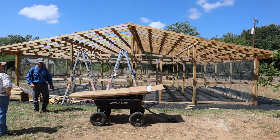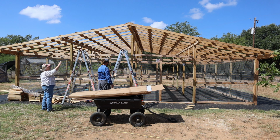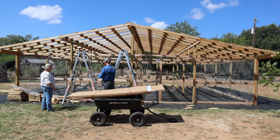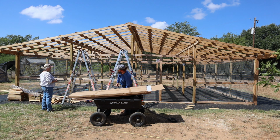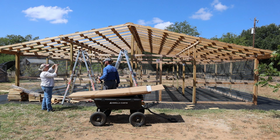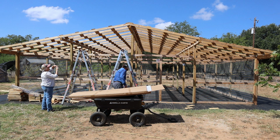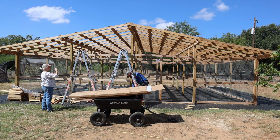We don't have the fascia on yet, but up here, what we're going to do is just hold up a 1x6, and he's got some clamps. That way we can get the roofing out over the top of the fascia board when it, you know, we're going to pretend it's there today, basically, with the scrap and some clamps. Yep. So that first piece will be out over that fascia board that isn't there yet. And then we'll put an L over the top and the side to hold everything together.